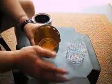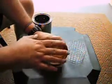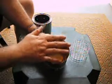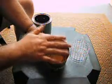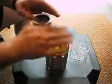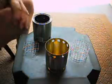Talk about loading the stove. You want to load the stove with small pieces of fast to medium burning woods. Stay away from the hardwoods like oak and walnut. They don't gasify fast enough, so you need faster to medium burning woods.